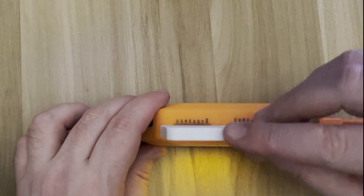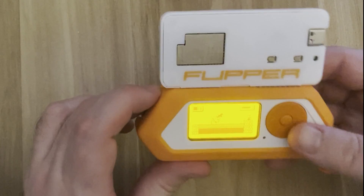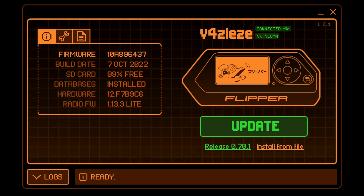It should now be safe to disconnect your developer board and plug it into your Flipper Zero. It's fairly easy — one side has eight pins, one side has ten pins; just make sure the chip is on the same side as the screen and plug it in. Before going further, you'll need to install different firmware on your Flipper Zero to give you Marauder functionality. In my opinion the best firmware is either the Unleashed firmware or the Rogue Master firmware — I have videos on my channel explaining how to install both.